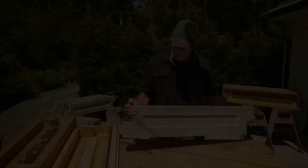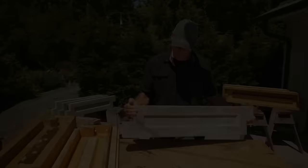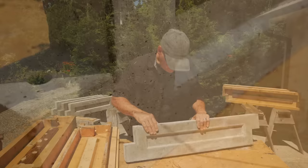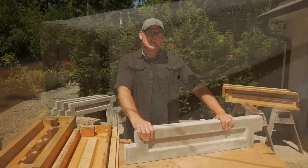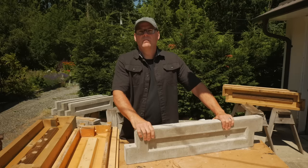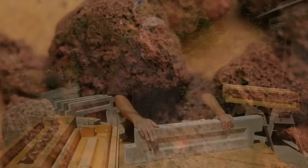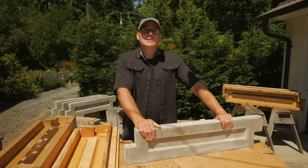As you saw, I substituted the gravel for lava rock in this first lightweight concrete attempt. The lava-crete worked very well once I used a variety of rock sizes that approximated gravel in my mix. The finish is very good, and the panel feels solid and durable. This panel is approximately 10% lighter than regular concrete. That's not a lot lighter, but I'd say it's almost equivalent in durability and strength. I had hoped it would be much lighter, given that the lava rock was about half the weight of the gravel. I suspect that the voids in the lava rock were filled with sand, cement, and water during mixing, so I lost most of those air spaces that would have made it lighter.